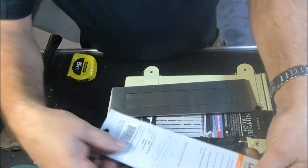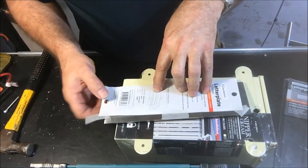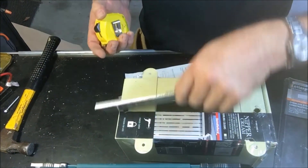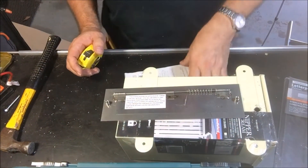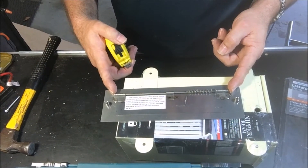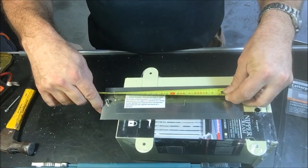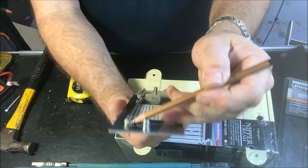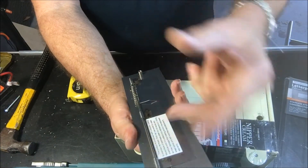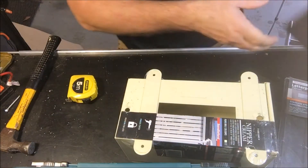The directions on the letter plate tag say it's a 35mm hole, which is a 35mm opening across here. However, because we're going onto a hard steel surface, this hardware here is going to have to fit inside the slot as well. So we are going to need to make the hole a little larger. I need to allow for the hinge and the spring hardware to all fit inside the metal, so that the surface here can butt flush up against the metal of the door.